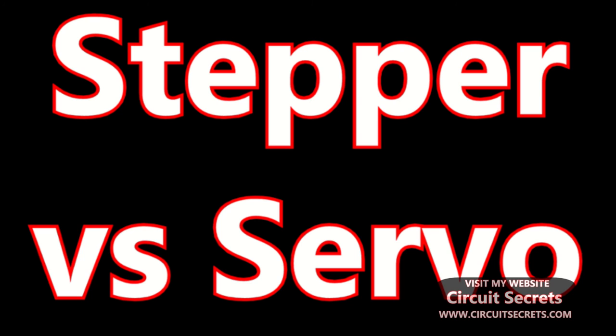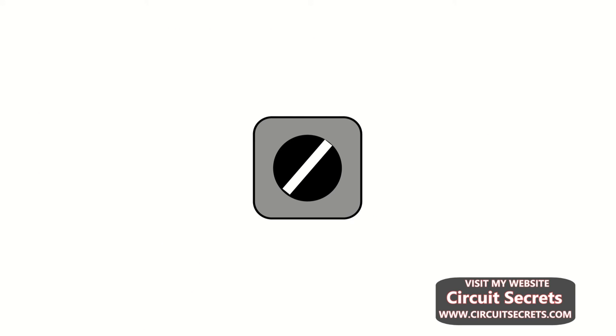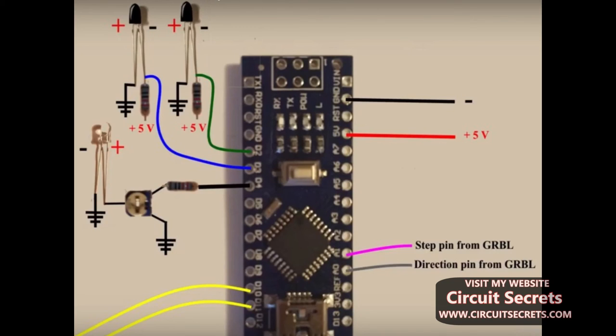With each pulse the stepper motor moves one step. After a step the coil remains energized, creating a holding force on the stepper motor that keeps it in place when subjected to outside forces. If the force overcomes the stepper motor's holding strength, it will move and jump a few steps. Because there is no feedback, the control system has no idea the motor is now in a different position — this can cause drift. With a DC servo motor control system, step pulses are read by the control board, the H-bridge drives the motor, and the motor moves smoothly until the feedback sensors confirm it has reached the desired position.